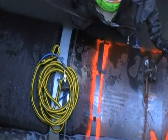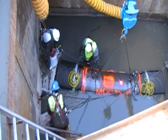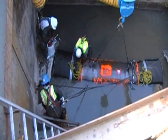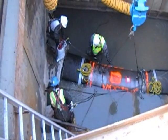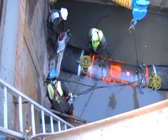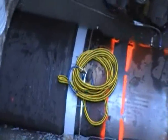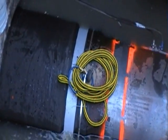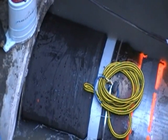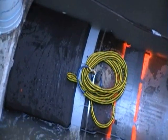Here we're preparing to pump the upstream diverter into place. The orange line has separated, indicating the diverter has moved forward. Each cylinder is operated independently so the diverter can be steered into place, minimizing the chance of it getting stuck or cocked in the pipe. The diverter slides on the pipe with a rubber cuff making a seal between the end of the diverter and the steel bypass pipe.